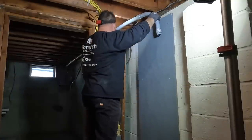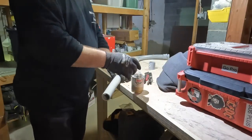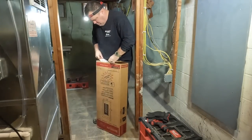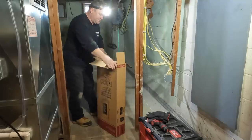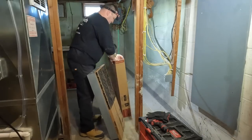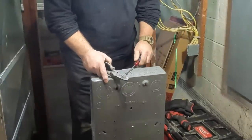I got the board mounted and now I'm getting my PVC attached to the bottom side of the joist here, and I'll go to the outside and reroute this conduit all the way back to the transfer switch. For the first day, I want to get my panel mounted and do all the inside work so that when I turn the power off the next day, it's not a long outage. This job actually took me a little bit longer than I had anticipated.